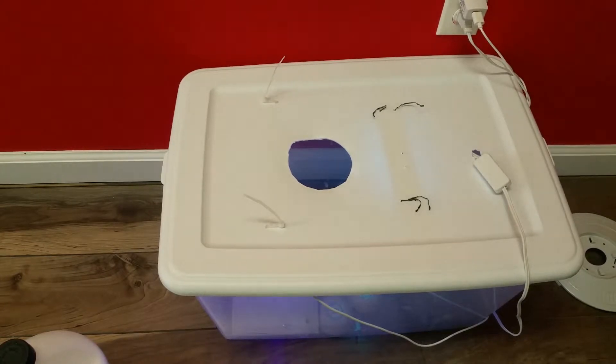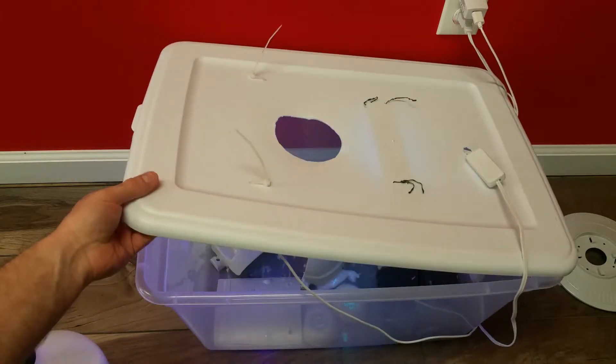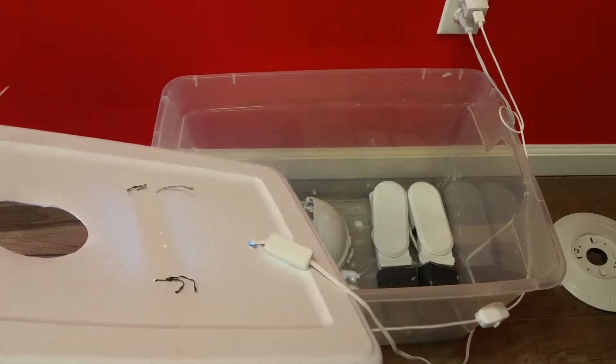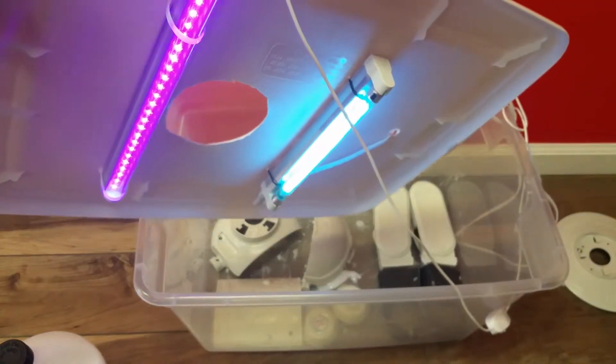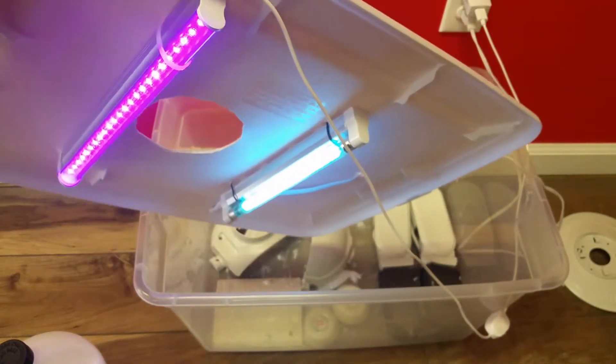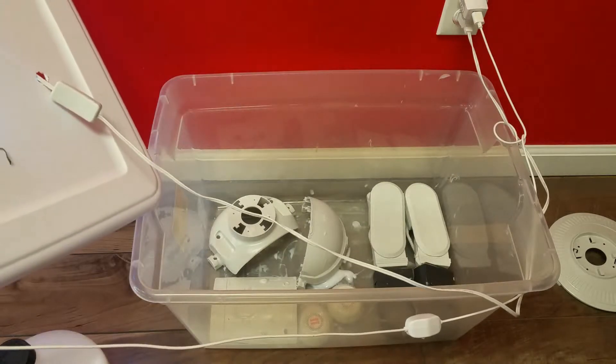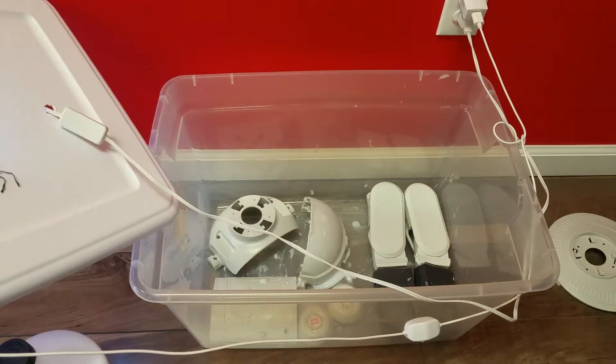While we're working on other parts of the robot project, let's take a look at what I'm going to do to whiten the corroded old 1980s plastic. Over time, the whiteness of those plastics turns gray or yellow. There's an easy way to remove that yellowing, although it's time-consuming. Right here is my rig for whitening — just a bin I picked up that I can do the whitening in, with blue lights mounted in the top of the lid. I'm creating a blue light radiation chamber that allows me to irradiate the parts to get them white, regardless of what the weather is like outside.